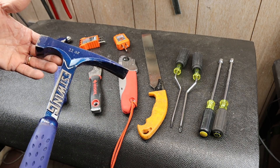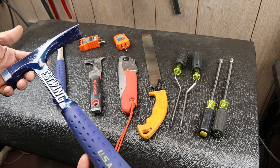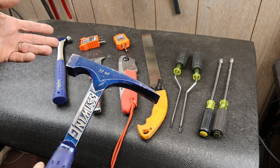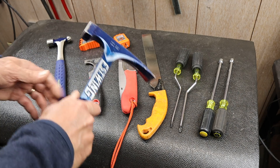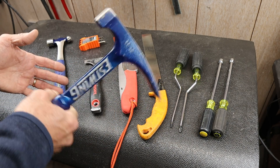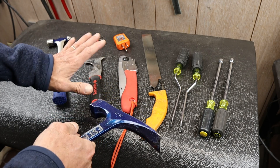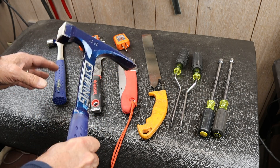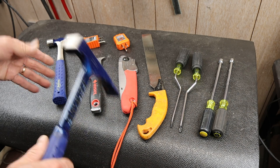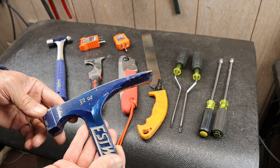What it does well is if I'm laying patio brick or doing cobblestones, walkways, things like that — which I do seem to end up doing a lot, especially in the summer. I used to do it with a pry bar and a big rubber mallet. Still use those for other things, but this just becomes an extension of my hand as I'm manipulating, lifting, adjusting the sand underneath, aligning and spacing the bricks. You can put it in and twist, tap to vibrate it to let it settle. It just becomes a total extension of your arm as you're manipulating paver stones, creating patios or walkways.